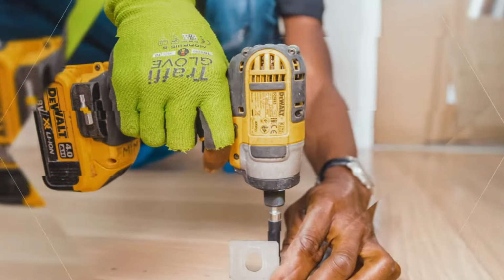All right guys, quick refresher. Anytime you see a hammer and a drill together, that means it's only for drill bits. Anytime you see a hammer only, that's for accessories like chisels and stuff like that, in case you wanna chip away tile or concrete, kinda like a jackhammer type of function there.